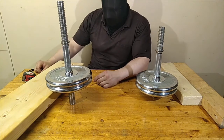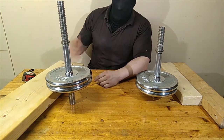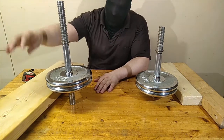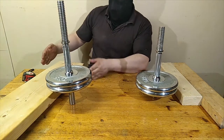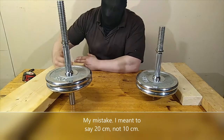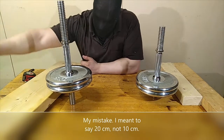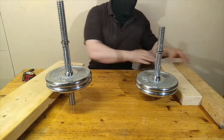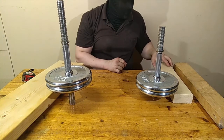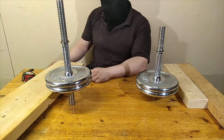So now the first step, I make the measurements on the board. Because I make the 2 layers, I need 4 pieces out of this, which are 10 centimeters wide, as this board is, and 10 centimeters high, meaning tall. So every 10 centimeters you get 4 pieces. And with this, you would need 8 pieces, since you get 2 pieces whenever you do this. All right, let's do that now.